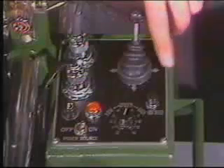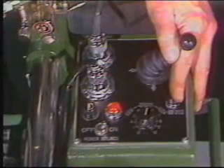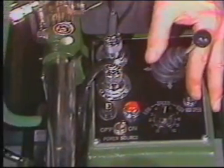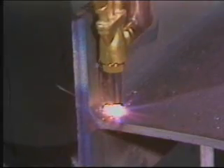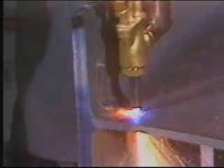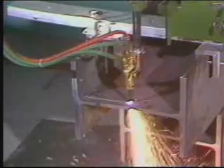To switch to the web cut, use the high-speed override to move the torch to the start of the web. After you rotate the torch 90 degrees, lower it into position, preheat, and start the cut. Tech tip number two: because the web is thinner than the flange, you should cut it at a higher speed.